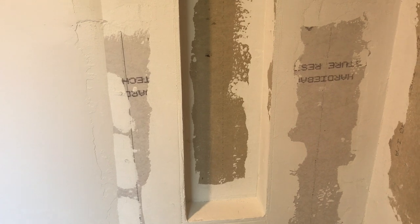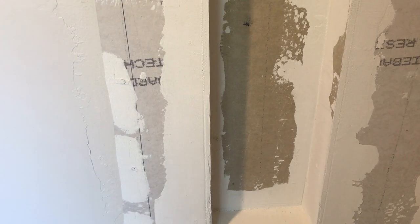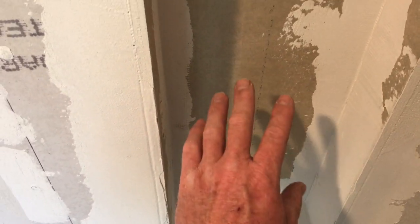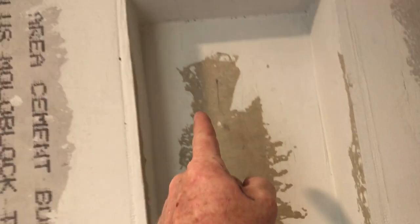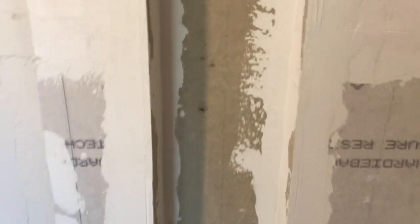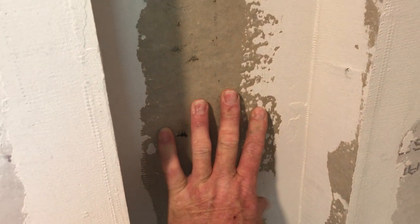Because this is an interior wall and I had nothing to screw onto, the process I used to affix this piece of hardy backer onto that roofing paper was concrete sealant — a rubber-based latex material that's also paintable and adheres to most construction materials including cement. I screwed this board down first, had these three pieces pre-cut, set the top piece in place leaving a small gap, squirted caulking all the way down — almost half a tube — pushed it onto the sealant, then screwed in both side pieces, using spacers and wedge spacers to hold it while it set up overnight.